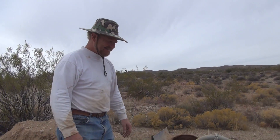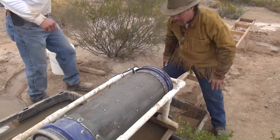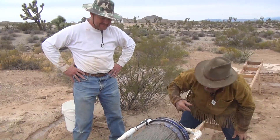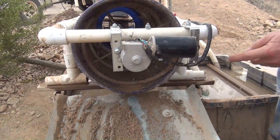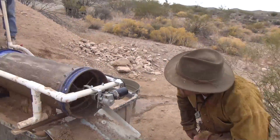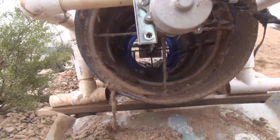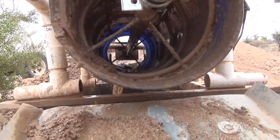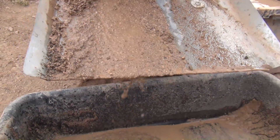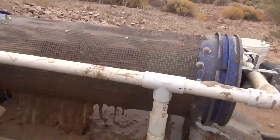The thing I liked the most was this dewatering screen — let's get down here. This little guy right here is clever. I've always tried to figure out how to build one without issues but could never do it. It looks like you got it to work. This is a 60-mesh screen built in here, and I've got tubing in here that acts like an auger. So when this thing is rolling around, your water loss is minimal. You can actually see the water flowing through the screen.